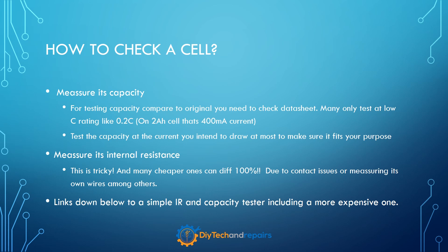Always measure the internal resistance as well. For fake cells I always recommend that, though for building a power wall it's a different thing. Be aware that many cheaper testers measure internal resistance very differently and may not be accurate at all — for instance with a cheap charger or tester, if you press the battery against the terminal it can easily differ by 100%, due to contact issues. I have links below to a simple IR tester, a simple IR and capacity tester, and also a more expensive one — both of which I use and recommend. They do things differently but both work for what they're intended for.